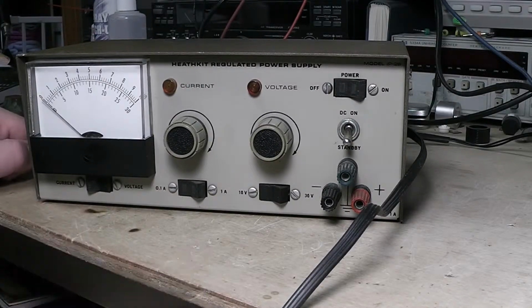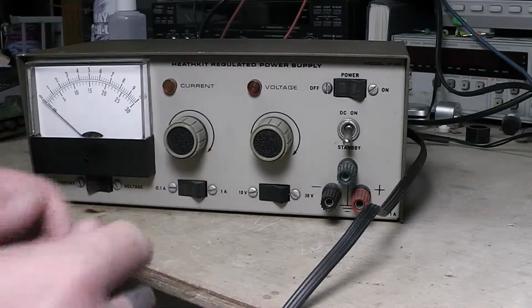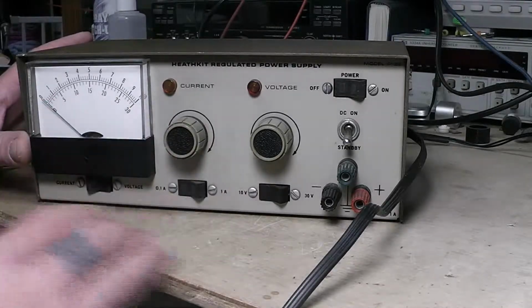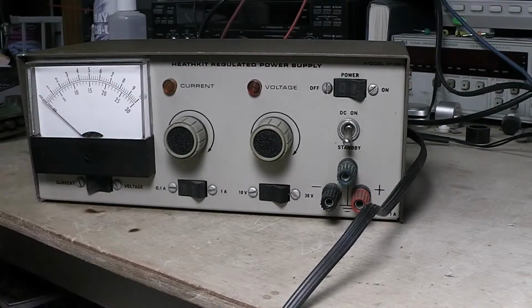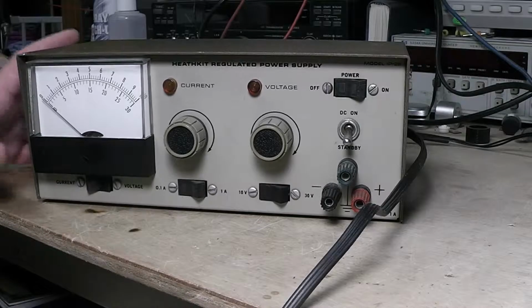And some of them will even tell you when you get some of these microcontrollers. Let's just say the microcontroller boards, like an Arduino or a Teensy board, where it's got the chip on it and the associated circuitry so you can experiment with it. It's got your GPIO pins coming out of it, like a Raspberry Pi maybe. You can experiment and then get what you want. You don't have to actually use the Teensy board or Raspberry Pi. You can take the chip and roll your own if you want to once you get it working with that, or you can just use that in your circuit. And most people do.